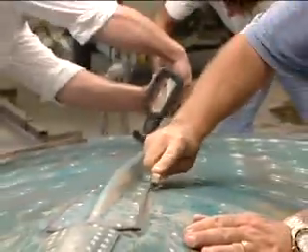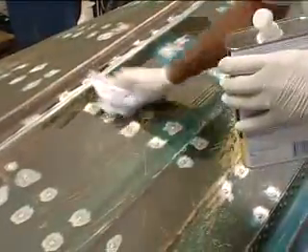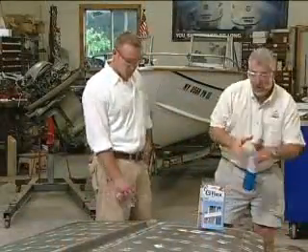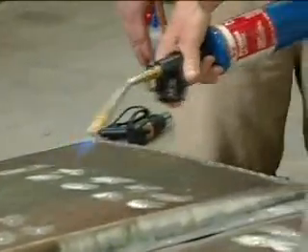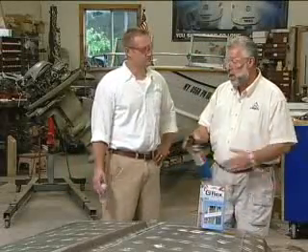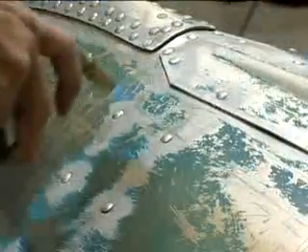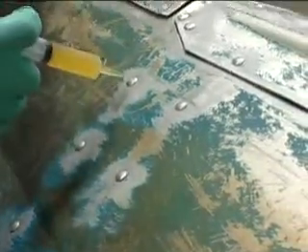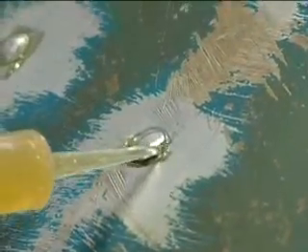You told Bert to grab some solvent and really wipe everything down. The solvent removes any contamination left on the aluminum. The next step is to get a propane torch and heat-treat all of these rivet heads in order to drive out any remaining water or solvent. But you don't want to keep the flame on the aluminum for an extended period — you want to make sure the aluminum doesn't get too hot.